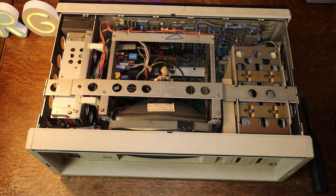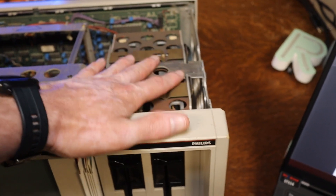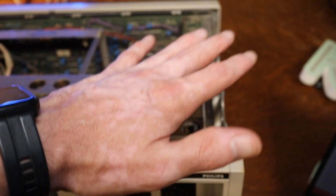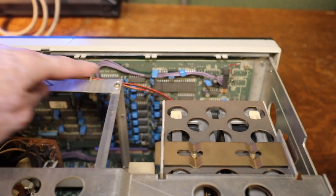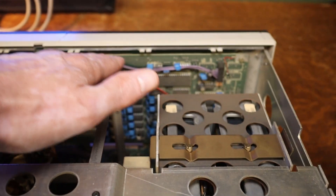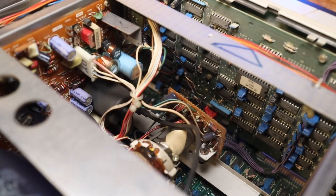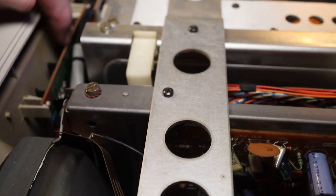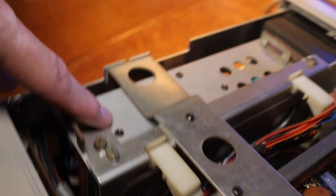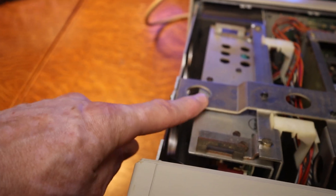Oh, that is amazing. Looking on the inside, here are the two 640KB drives. This is the P2012 model, so this has the two biggest drives. Other models have either one drive or two 160KB drives. On the back here is what is called the terminal board, and this drives the CRT, reads the keyboard input and does the beeper. Here is the 9-inch CRT with the power board on the left with the flyback transformer. And then here is what is called in the manual the distribution board. But the part we are interested in is this — the power supply, and this is where the magic smoke came from.